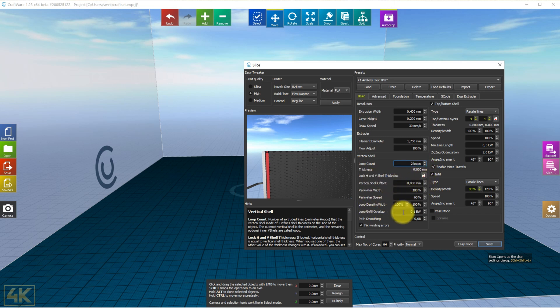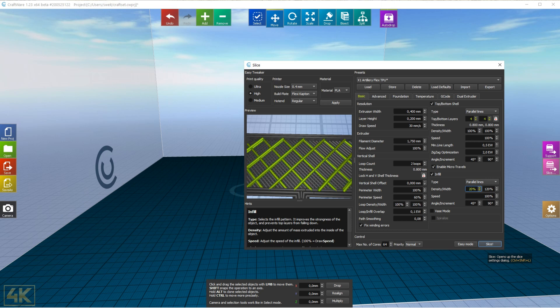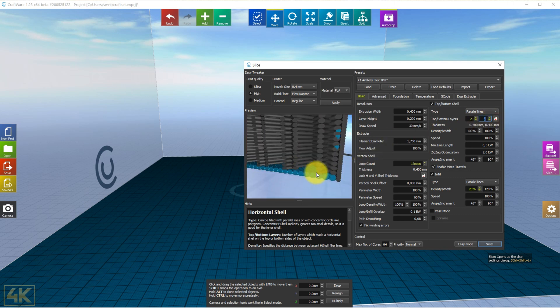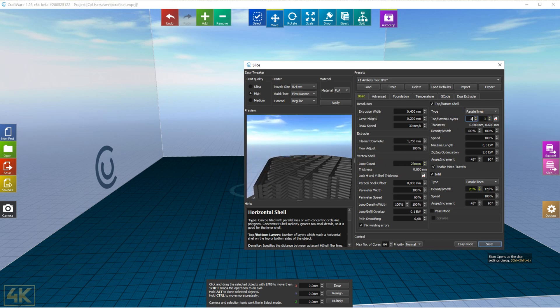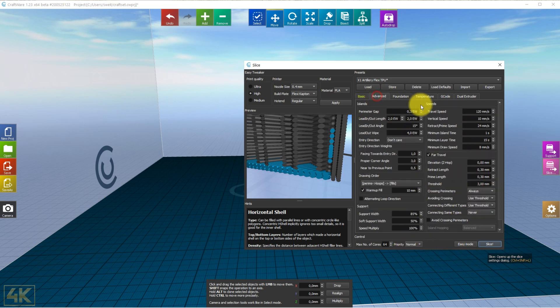The perimeter speed is set to 60. The infill density here is for the wheel specifically, but for most other prints I normally use around 20%. I have top layers set to four, but it should really be three top and three bottom layers. The infill was 20%. Then we go to the Advanced tab — there is nothing to do there, I normally never touch this.